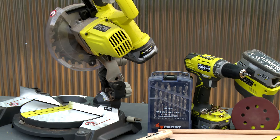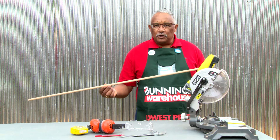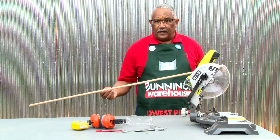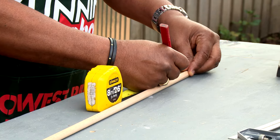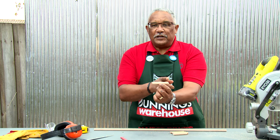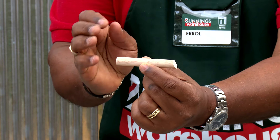These are the tools and materials needed to do a wall-mounted coat rack. This is the dowel we will use for our coat hooks. I'm going to cut five at an angle of 22.5 degrees — you can cut as many as you like. Measure and mark the size of your hooks; these can be as long or as short as you want. As you can see, we have a 22.5 degree on one end and a 90 degree on the other end to give us a nice finish on our coat hook.